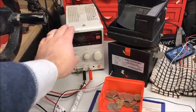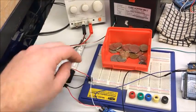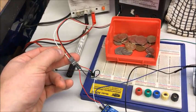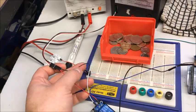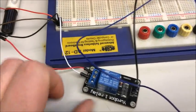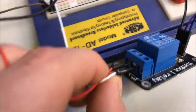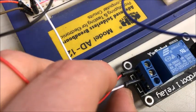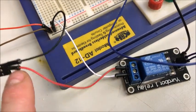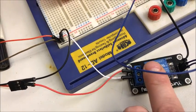We're going to start hooking this all up now. We've got 12 volts from the supply coming into the breadboard. Looking at the coin hopper first: we've got live, neutral, and then sense. The neutral comes from the power supply, and then we've looped the live through the relay — it's normally open, and a low signal will close that and make your circuit live.